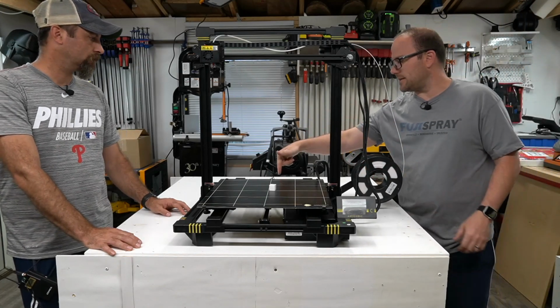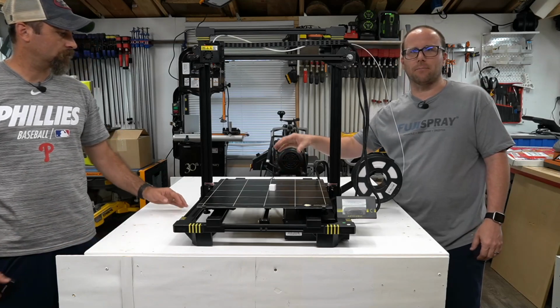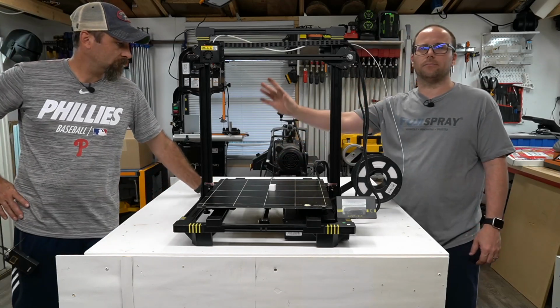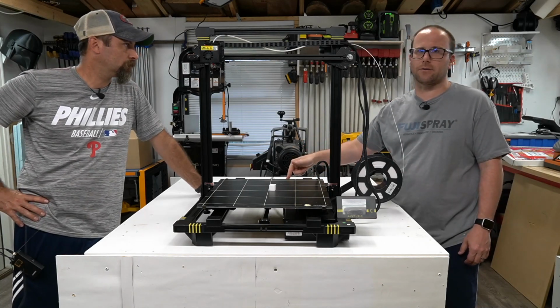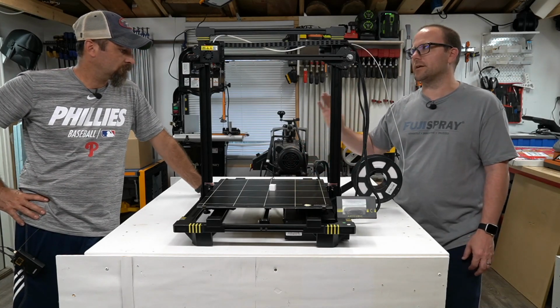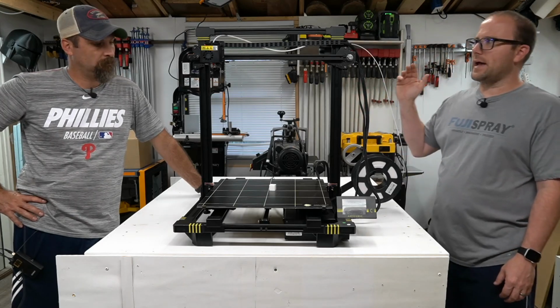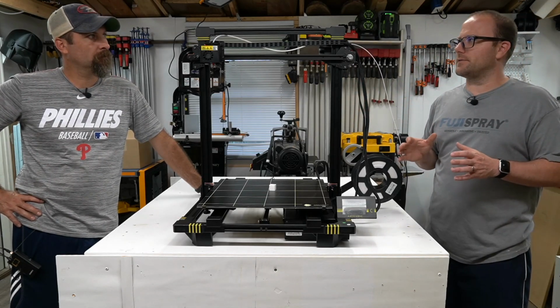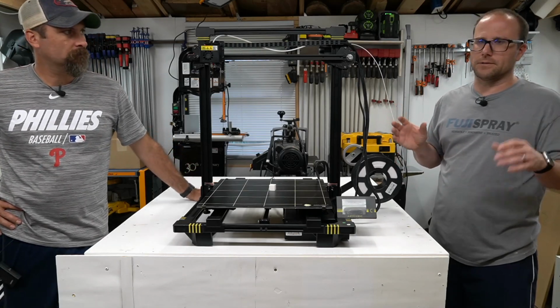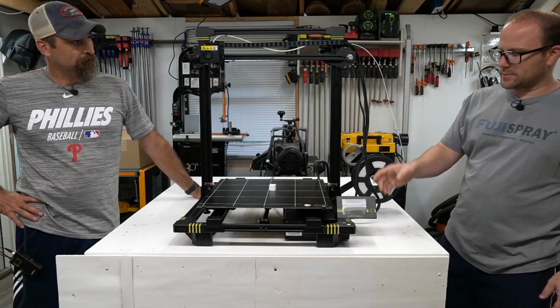On the back Y-stepper, it does have a motor dampener. None of the other motors do. It's kind of odd because you're hearing it. Maybe that one's louder without a dampener. I put that on the Ender 3 before. They had the silent board, and it did quiet it, but with a silent board, the drivers make a world of difference. Yep. So that's what's up.